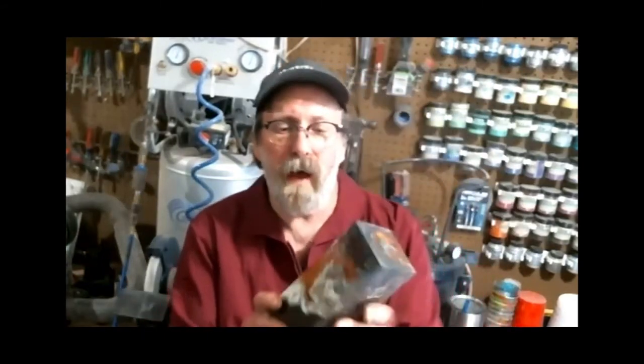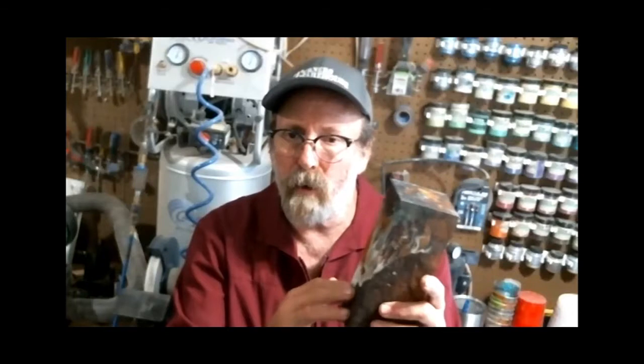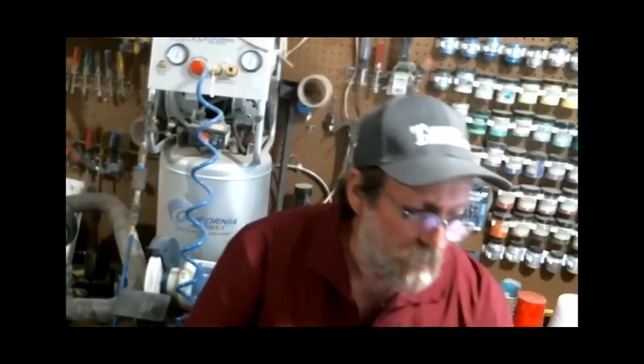My advice to you all as wood turners is, if you're trying to do a cast where you're building up on a piece of burl, or you're building up something and you're adding on to a piece of wood, then this is the resin for you. If you're trying to fill a small void, say you turn a bowl and it's got a nice little natural crack in it, and you want to fill that, then this is not the right resin for you.